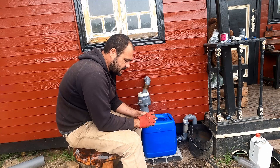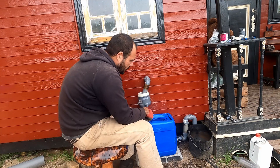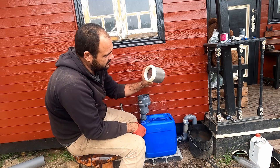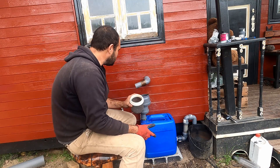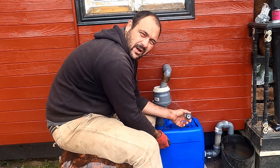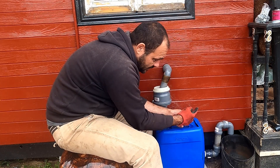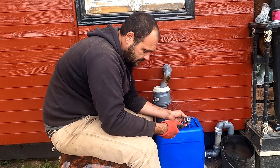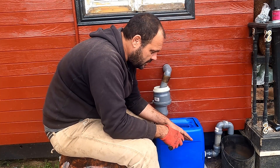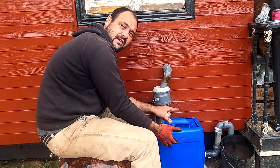I want to have this over here where the oil can come out, a couple of millimeters above the water line. So I'll wait for that to stop — let's take this out. So that's all the food particles — we're getting them before they go into the system. The higher you do it above the water line, the more grease will just sit here. I want to go as close as possible, but not too low, because when you fill it with water it comes up a couple of millimeters. You don't want your oil bottle getting filled with water. It's better to do the hole slightly higher — that way you can put a wedge underneath and raise it a bit.